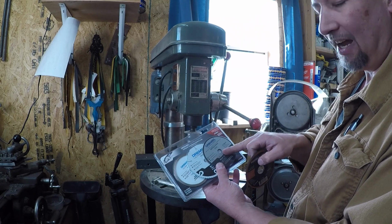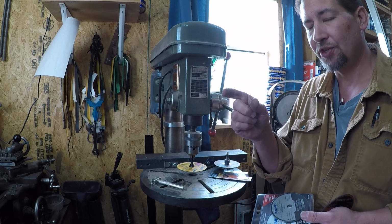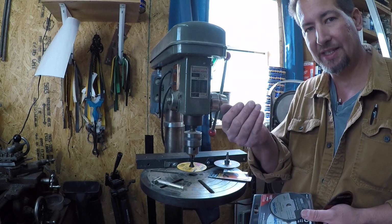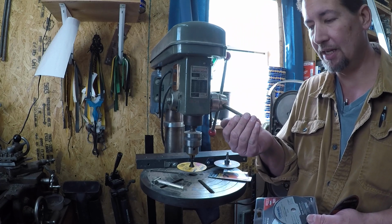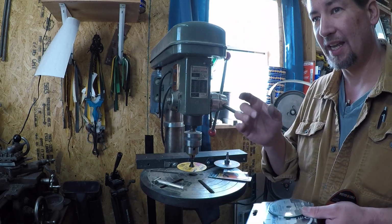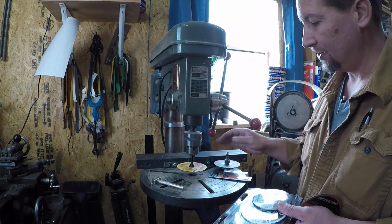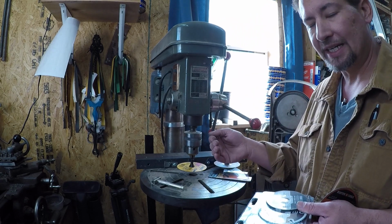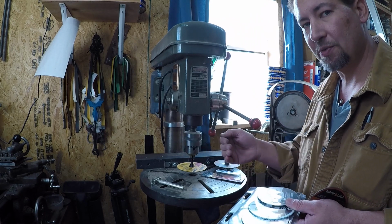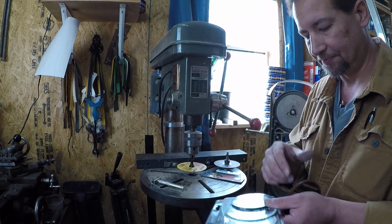This is a 3.5 inch diameter set, which will make a shorter nail nick for the amount of depth that you can go in, because it's a smaller diameter wheel. If you want a really wide one with a really shallow depth, you either have to start your cut and then move it back and forth this way, or go to a larger diameter wheel.